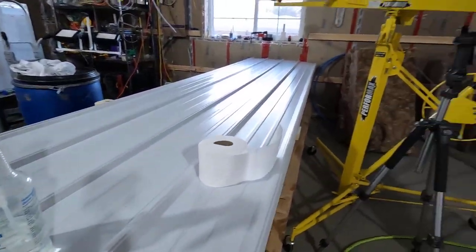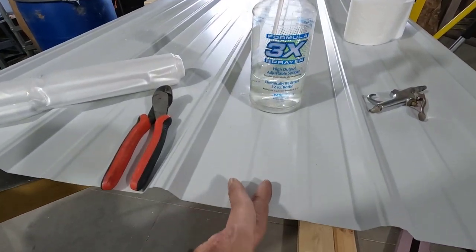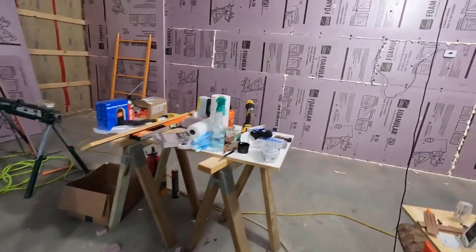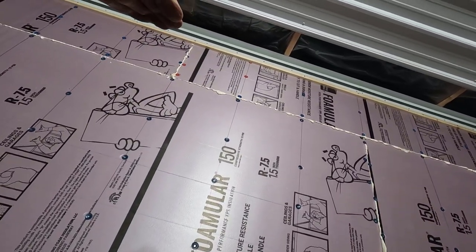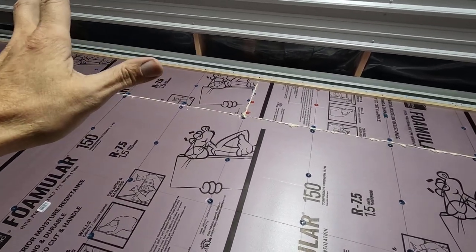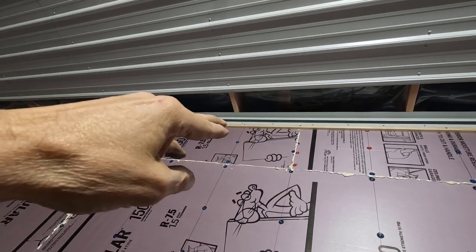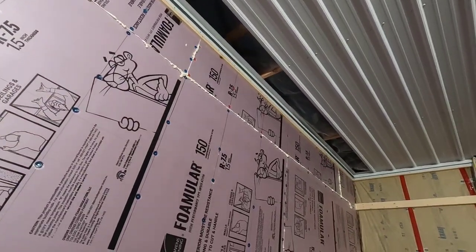This is the siphon edge. This goes over the panel that's already up there, and it's gonna be about right here, about that much of the panel. I gotta cut it all the way down and put three strips in there. Yeah, that's gonna be interesting. It's gonna have a flat part going into the opening up there, so I may have to rivet it to that. I don't know, we'll see, because I'll be putting a screw right up through there, so if it kinda sags down in the middle, when I'm up on top, I'll put a rivet through it, and that should hold it just fine. Yeah, looking really good.